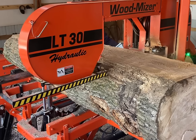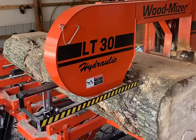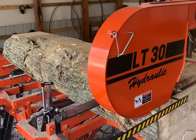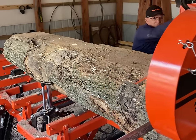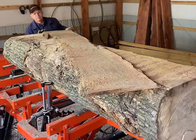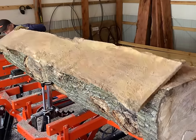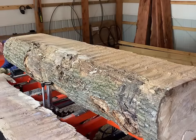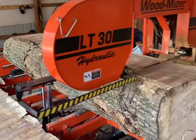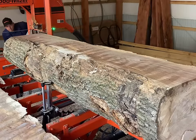For those that are unfamiliar, there is 27 inches between the guide rollers when the throat is opened all the way up on the sawmill. In the video you're looking at, I have it all but about three inches from open, and in places I'm just clearing the log by about an inch and a half on each side. So the piece I just rolled off is at least 20 inches wide in places and probably weighs somewhere around 100 pounds.